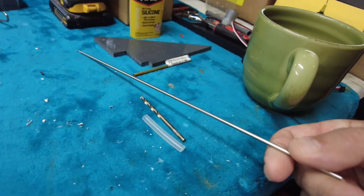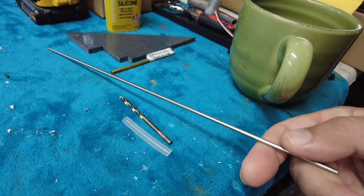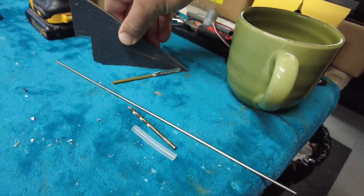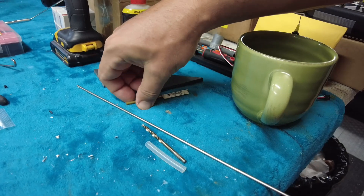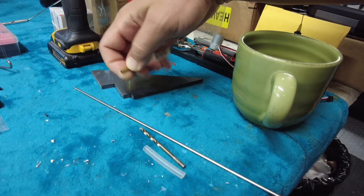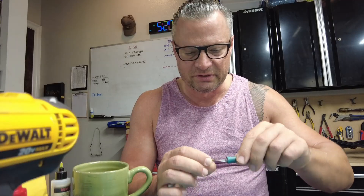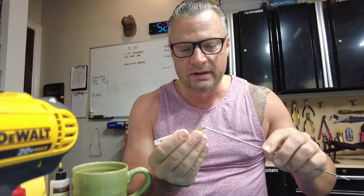In this particular case, we're going to have a 1/8" stainless steel drive shaft coming out of this mocked-up wall of our watertight cylinder. What you're going to need is a bushing that will go around the outside, and you want it to be a fairly tight tolerance fit. In this case, this is a 5/32" sleeve on a 1/8" shaft.